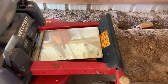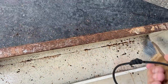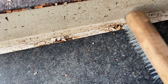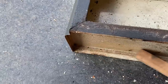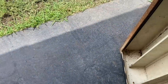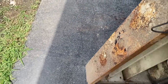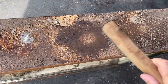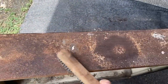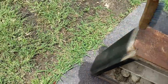Hey, horsey and gun people. I have this little medicine cabinet out here for my horsey medical stuff, and it was really getting rusted and kind of just caking up. So I've been using this rust converter on a lot of things. You see this kind of rust that I'm just knocking down with this wire brush — that's the only prep I'm doing. Over here it's not too bad, I don't even think I need to knock this off. The bottom is pretty rusted. So I am just knocking off a little of the top rust.